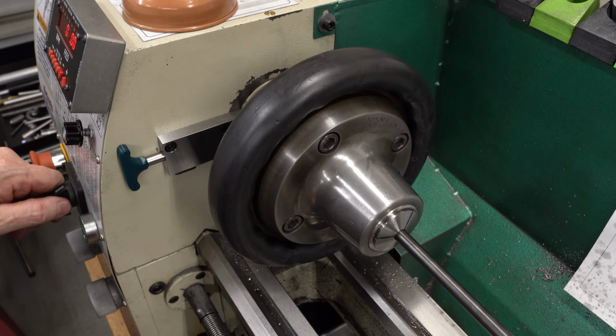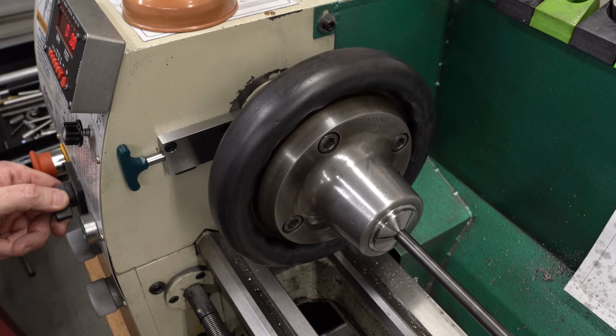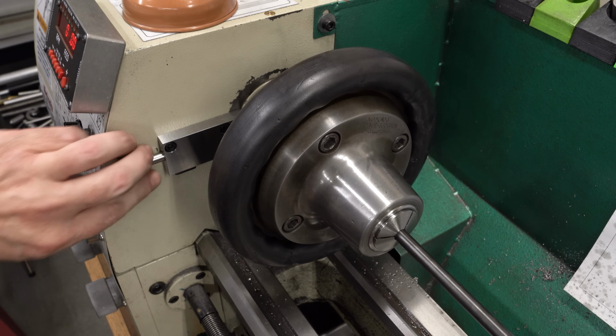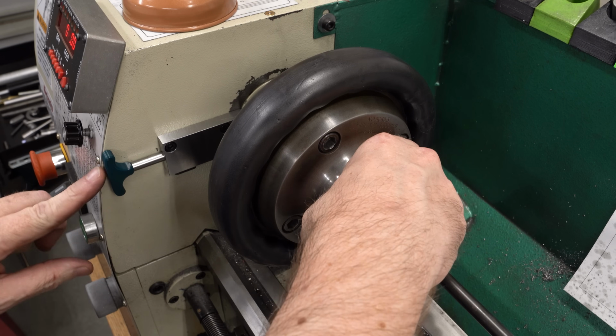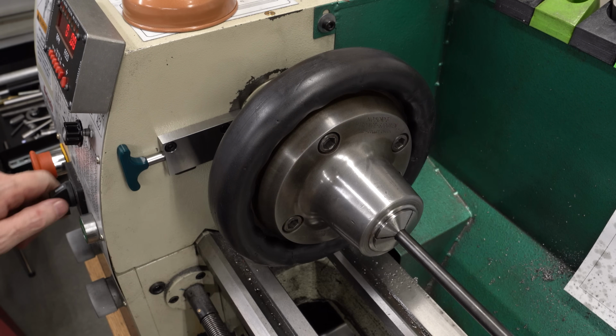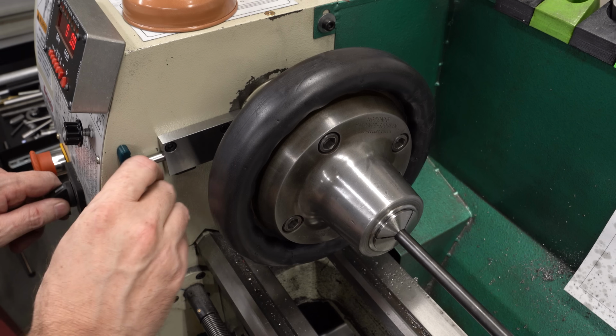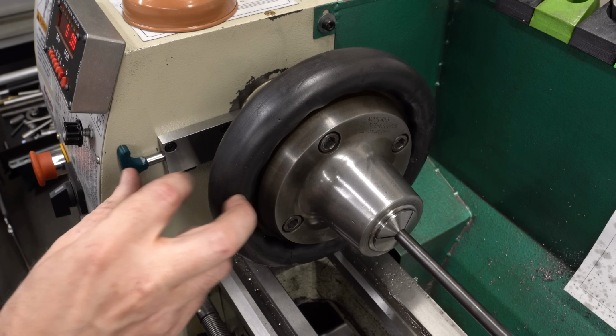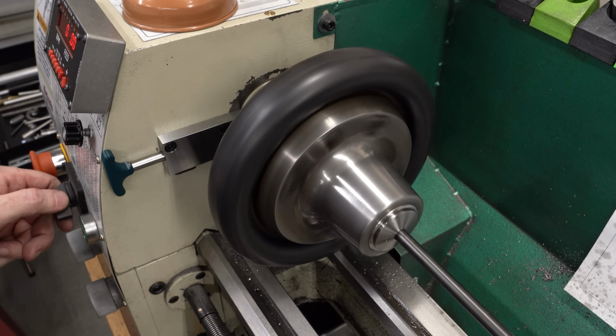I've got it locked. I've reconsidered my life choices and nothing happens. That's unlocked. That's locked. And as you can see, the VFD really can't do anything about it. It starts up when it's running slow or when it's first starting. There's so little torque until it gets moving that the VFD really can't do anything. All you can really do is just hear the fan starting up.